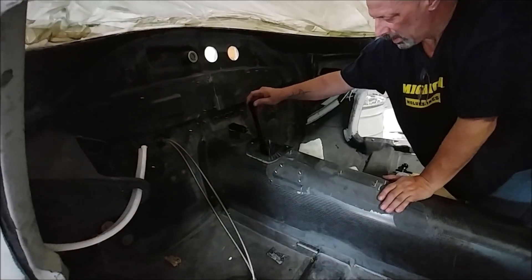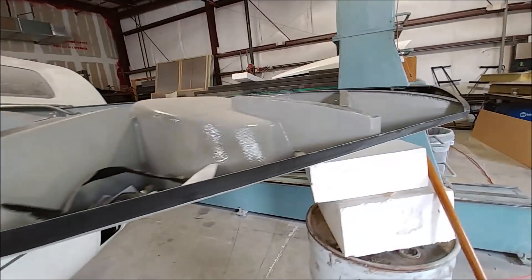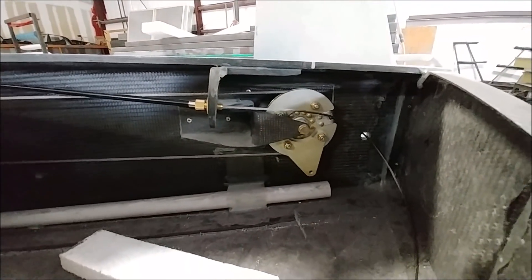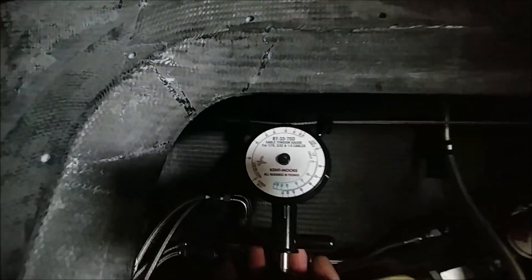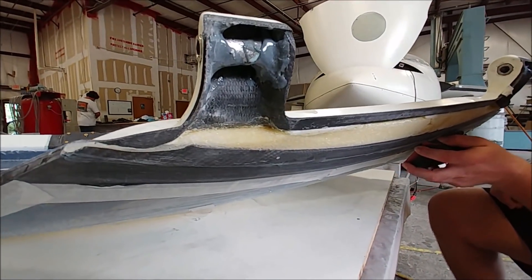We finished the cabling for the aileron rigging. Here's Jim moving the stick back and forth — the center stick connects to the side sticks, you won't actually use it directly. There's one of the aileron bell cranks moving, and it'll have a push rod connecting to the actual aileron out in the wing. Here's Jim showing how we've got the tension working — it's reading basically 42, and it'll come down a little bit more as we let the cable stretch out some more.